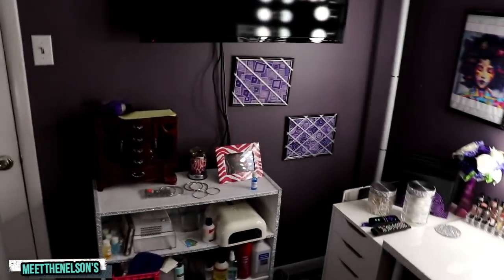It took me a while to do this vanity, no lie. The vanity didn't come as thick width-wise as I would have liked, and because I had a dimmer going into it — and the dimmer is pretty thick — I had to put a hole in the back of the wall where the dimmer sits. I put an actual blank junction box behind it so the wires don't touch anything, electrical taped it, and made sure it was safe. I had to do a lot more work than I expected that day, but I got it done. Hopefully you guys enjoyed the room tour — this is my wife's makeup room and she absolutely loves it.